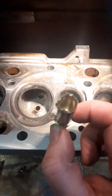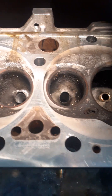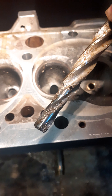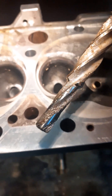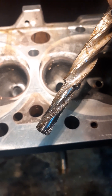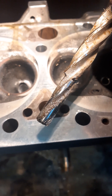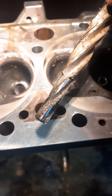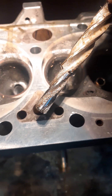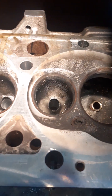What we do first is drill out the Amco guides or manganese guides with a special drill. It is prepared especially for this tough manganese bronze - it is welded with tungsten carbide eccentrically. On a couple of tips I've welded a thicker layer of tungsten carbide so the drill works itself free. If you use a normal drill in manganese bronze or Amco 45 bronze, they'll just seize or stick because it's a really clamping, difficult to drill material.